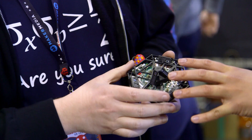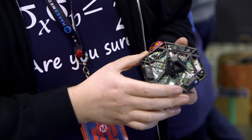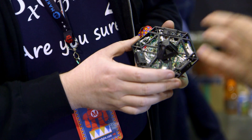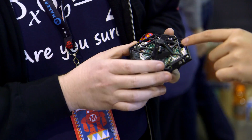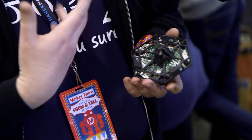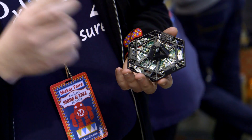So think of it like a smartphone picking up satellite signals from GPS satellites that are orbiting the Earth and triangulating its position to a much higher degree of accuracy. Are these sensors expensive to make? Are there a lot of logic that goes with them? No, they're relatively simple. Each sensor has a photodiode. We've also invested quite heavily in making a custom ASIC solution for baking down all the electronics, so it'll be a very small and very simple thing to implement. Basically, someone will just grab one of these photodiodes, one of these pieces of silicon, stick it on a board, and they're done.